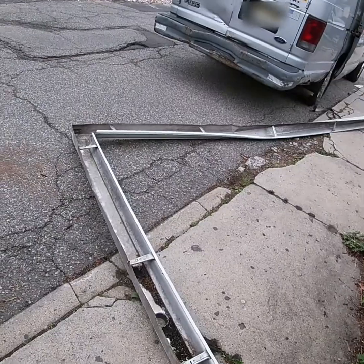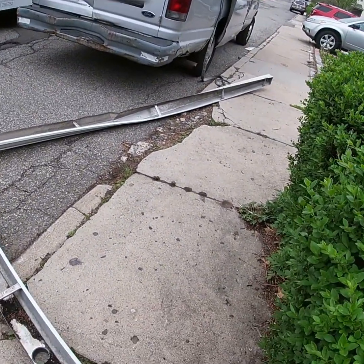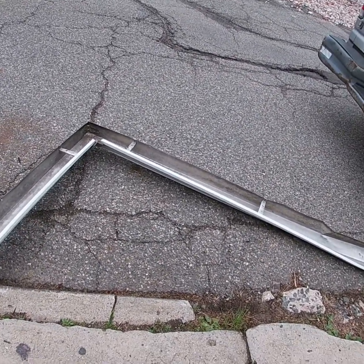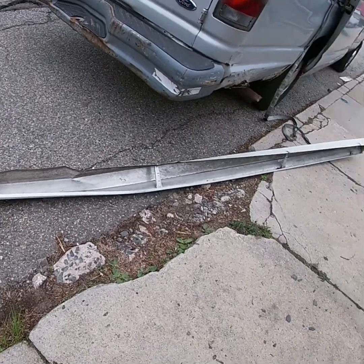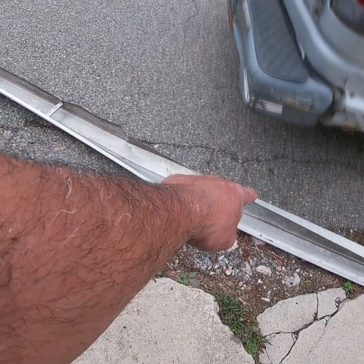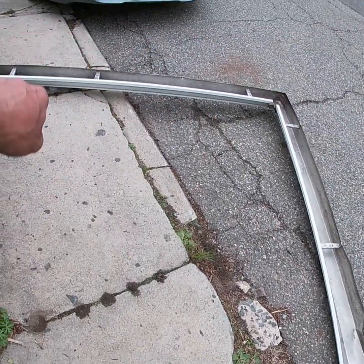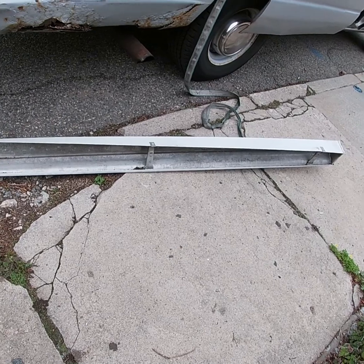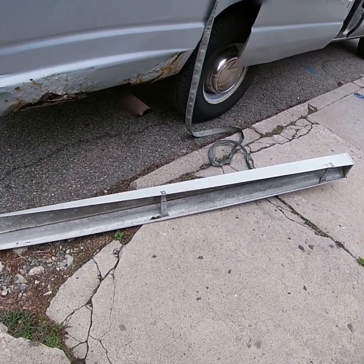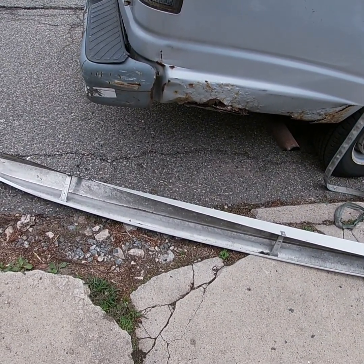All right, so if you look right over here, here's a piece of gutter. It's all bent up right over there. What they did was they used 8 hangers throughout the entire piece. This piece right here is 14 feet long. That over there is about 6.5 feet long, and they only used 8 straps altogether. They should never have only used 8 strap hangers.